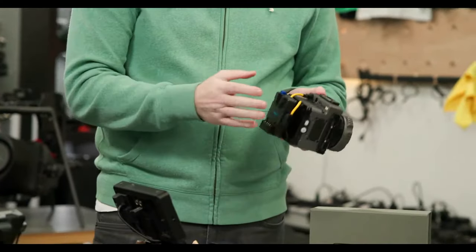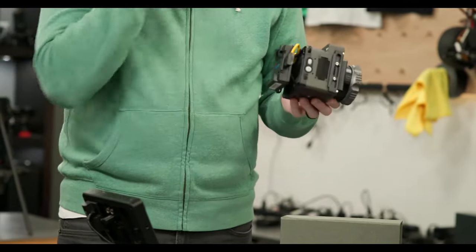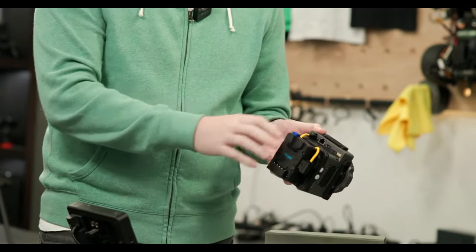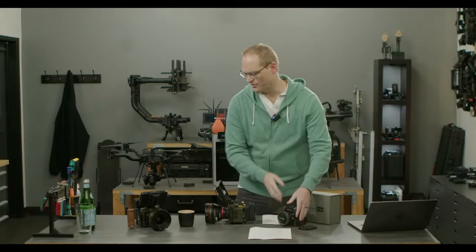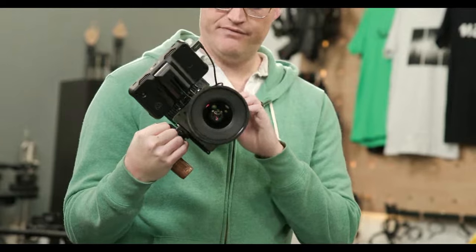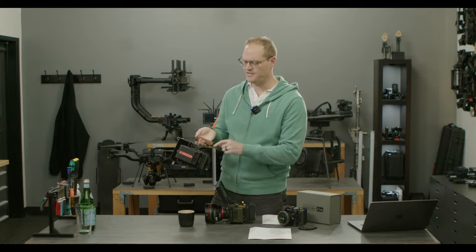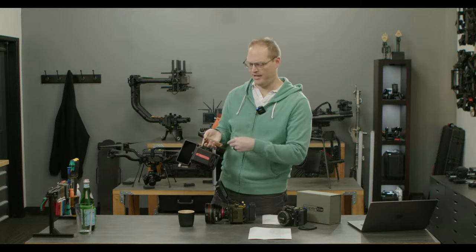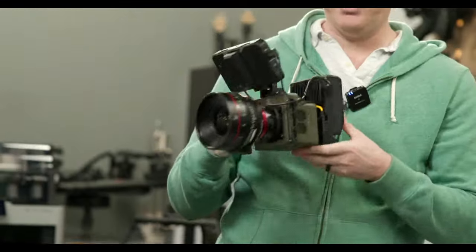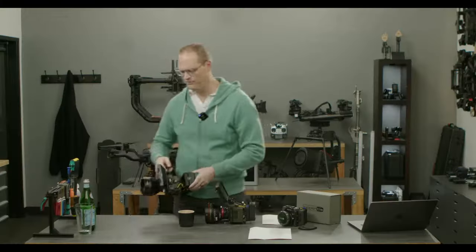We've got different battery options. This one's set up with just a tiny micro V-lock option that's set up to be as small and lightweight as possible — it just comes from a D-tap connector right into the micro-fit connector on the Ember. For bigger, longer run times, we have our SL4 battery which has a big, fancy power plate. You can power this via USB-C input and it'll power everything, charge the battery and power the camera. There are also two high-power USB-C outputs as well as two raw voltage outputs.